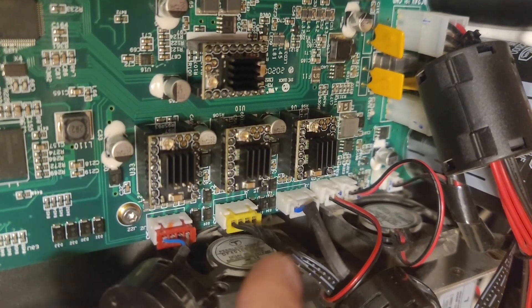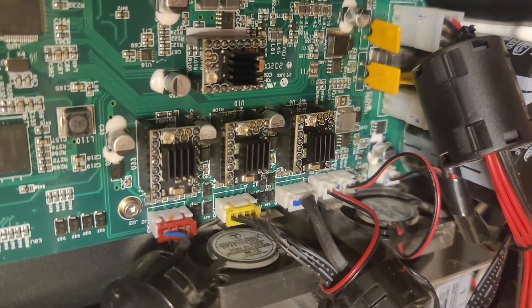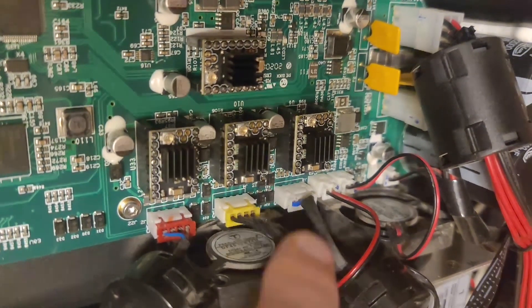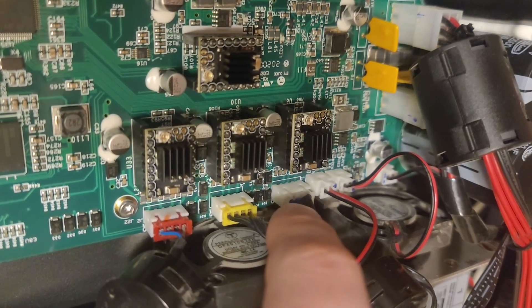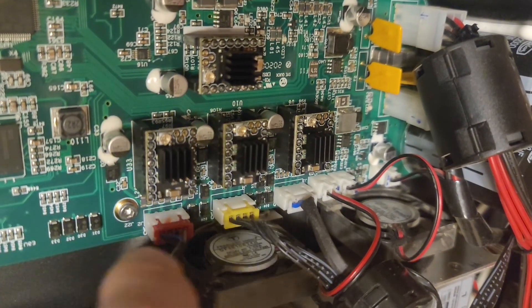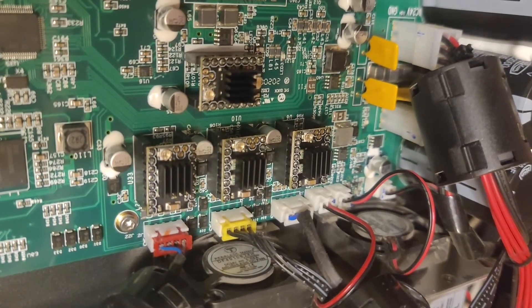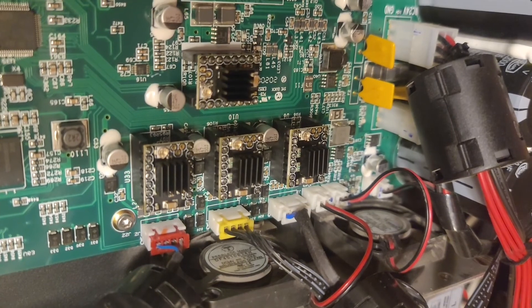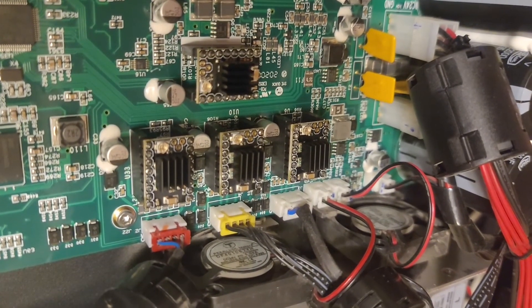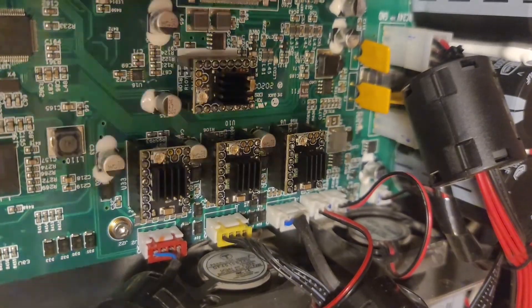Some say they're glued down, so you may be in trouble and may have to cut them off and just put them on without the connector. What I did was pull all these out, take my pliers, pull the plastic outside connector off, realign the holes, spin the connector around, put it back on, and then reconnect. That will make it so your X, Y, and Z motors actually go the correct way — they'll be reversed when you first put these in.